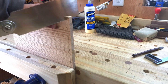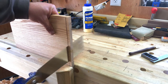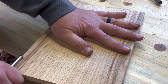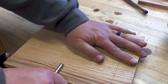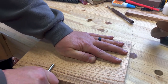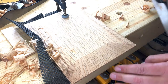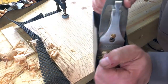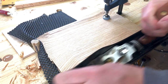To explain the tools I used so far to prep the white oak: I used a Bedrock 607 jointer plane, a Wood River 4½ smoothing plane. For the grooves on the insides of the picture frame border for the raised panel I used a Veritas small plow plane with a quarter inch blade set at a quarter inch depth and a quarter inch from one edge, maybe slightly less on the other just to give it a little room for expansion. Then I used a combination of a Wood River low angle jack plane and a Wood River 4½ smoothing plane to plane the raised panel edges.